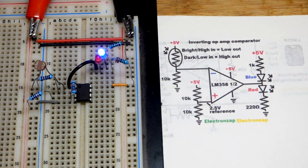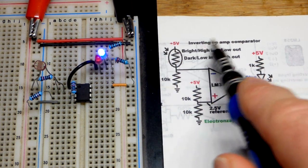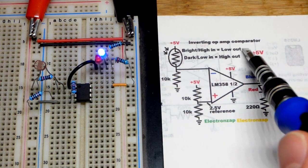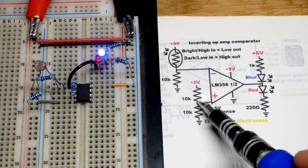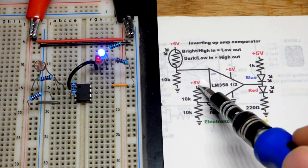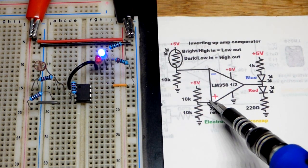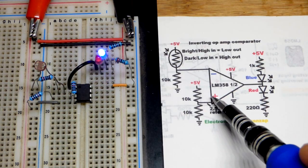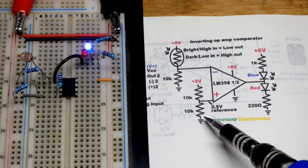To accomplish that, I took an op-amp and wired it up to be an inverting op-amp comparator. We have a reference voltage — that's where the comparator part comes in. We have a voltage fixed to whatever the supply voltage is, and the voltages at both inputs will change based on the supply voltage at the same time, so it doesn't matter. It's half of the supply voltage — that's the main thing — at the plus input, which is called the non-inverting input.